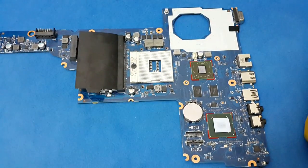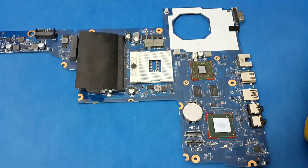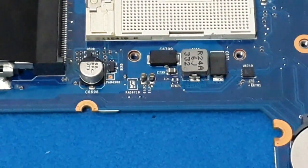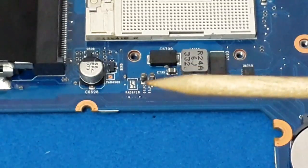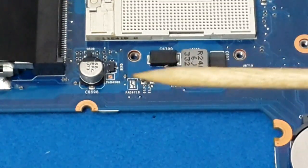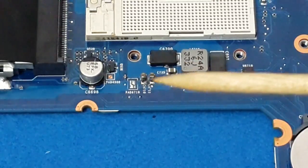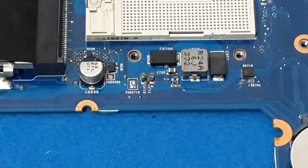Now there is always the question: what is the value of the original capacitor? A capacitor in parallel to the voltage source is always about 0.1 microfarads and is used to reduce noise. A capacitor next to another capacitor is used as a circuit tank to supply more current, and most of the time its parameters — capacity in microfarads and voltage — are equal to its neighbor. So I can remove the neighbor, copy the data, and replace the capacitor with the same information.